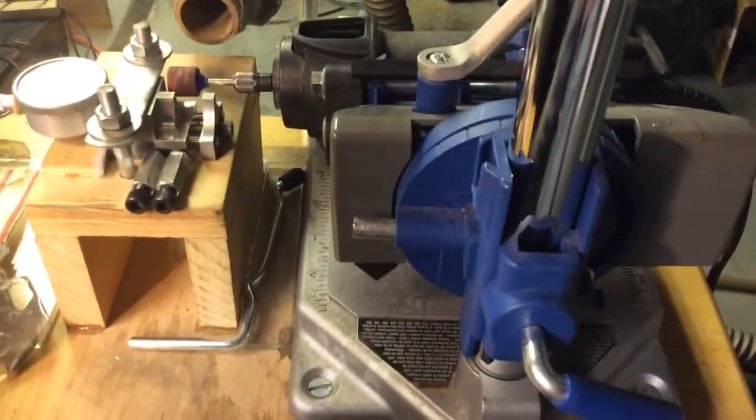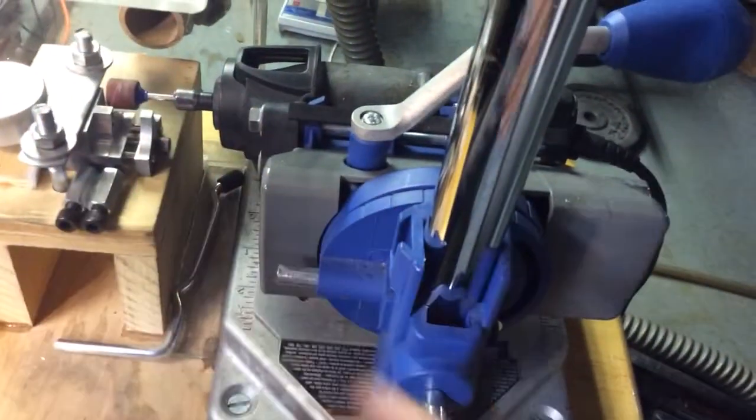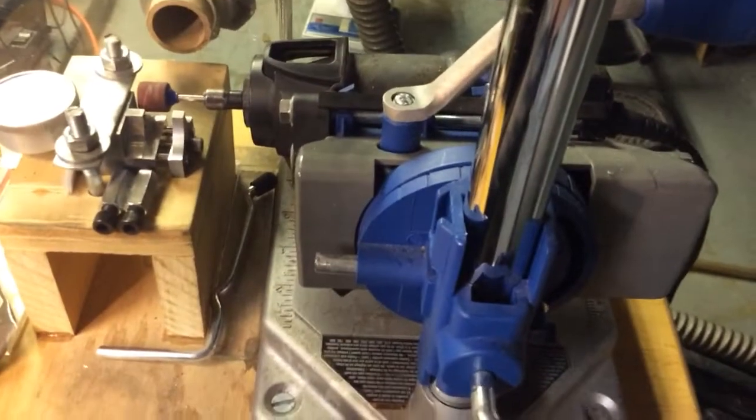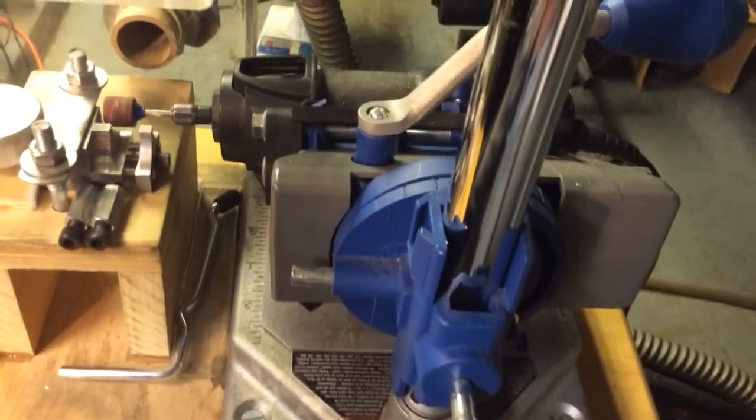There are little adjustments here I stuck on to move this thing around kind of like a lathe. And then these U-bolts hold it down with nuts and hold this thing tight. Once you get it set, you can do a whole bunch of arms. It doesn't move much. You've got to adjust gradually as the drum wears in.